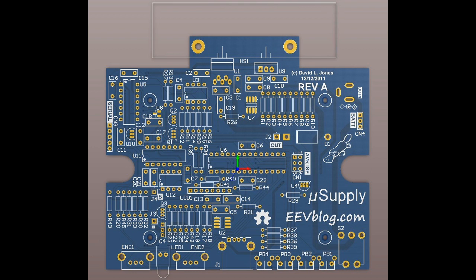I probably didn't have to split that ground plane. Actually, if you're asking exactly why, there's probably not a real genuine electrical reason to do that. It's just good practice, really. I just wanted to separate the right-hand side power, which can carry several amps, and may be switching. Because this is a power supply supplying an unknown load, you don't know what it's actually going to be powering, and that could be putting all sorts of strain on that ground system.